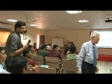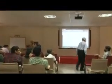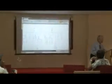And how do you regulate when everything is different and everything is valid? That is a difficult task, of course, or you wouldn't have asked. But actually, with anybody's software, you can enter for each piece of equipment how it performed, whether it takes 3 cycles to open or 7 cycles, and whether the relay coordinates an electronic relay that does something wonderful, or an old induction disc that works or used to work, and you get all that data into your database, which is crucial on the single line.